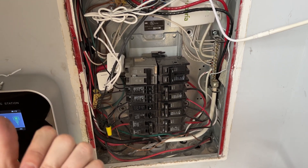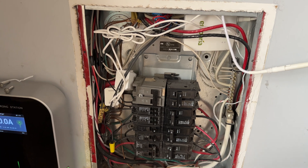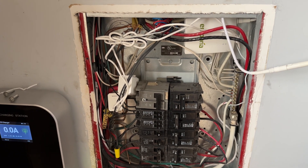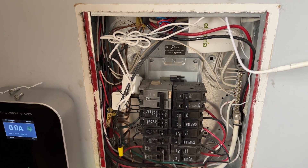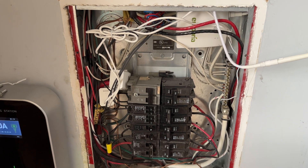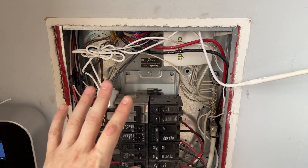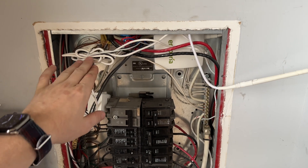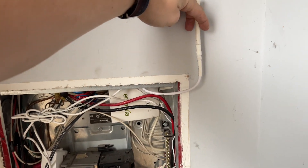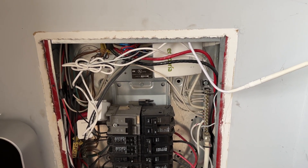Just flipped down the breaker. The black wire is load one, red wire is load two, blue wire is load three, white is neutral. I've found that if you tie black to your load on either leg of your split-phase — 120 or 240 — it reads voltage just fine. On the off chance you have a 15-amp 240-volt circuit you can use both legs. I've got the clamps in facing the breaker, things out of the way, not tied to any high voltage to minimize crosstalk. I'll just have to sandwich the wi-fi antenna.